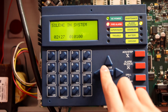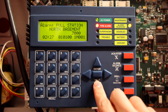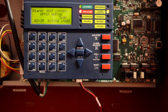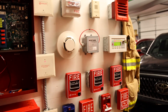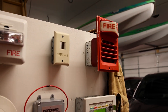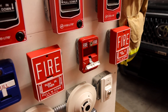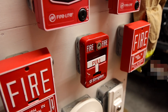All right, so if we look on the panel we should have two alarms. Yep — the pull station in the north basement and the conventional heat detector that's in the upper garage. That's just a demonstration on how this fire alarm control panel can differentiate between the different points on the initiating device circuit. So that strobe continues to flash — we'll go ahead and reset this pull station before we reset the heat detector. There we go, just like that.